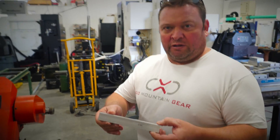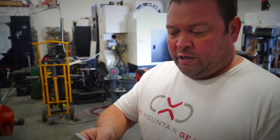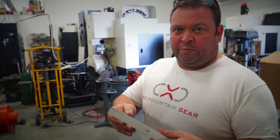Here's that raw material after it gets cut in the automated chop saw — again, the 6061 aluminum. This is going to go into three different fixtures for operation one in the mill, and then we're going to take it out and put it into another mill to do the second operation that finishes the pic rails.